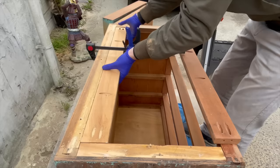Because I found this dresser on the side of the road, I didn't expect it to be perfect. But when I removed the paint, the sides turned out to be actually really damaged. And because there was so much veneer missing, lots of holes, and someone tried to sand it previously and they sanded through the veneer, I decided after lots of thinking that it was probably too expensive and just not worth repairing the sides, and I patched the holes and decided to paint it.